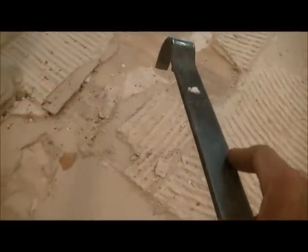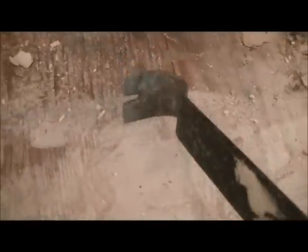And that's the other problem. The fact that he used liquid nails is actually better than thinset. If he had put thinset on this plywood and then nailed or screwed it down, it would have caused a lot of problems pulling the plywood up — the thinset would have wanted to pull the plywood up, and then I'm running into a big issue trying to get the floor smooth again.